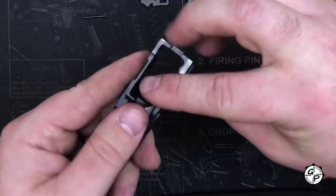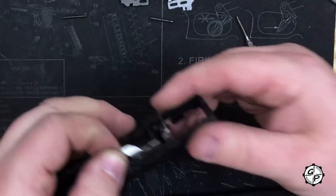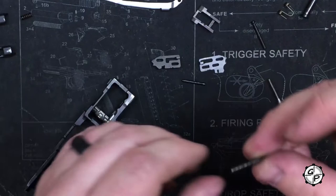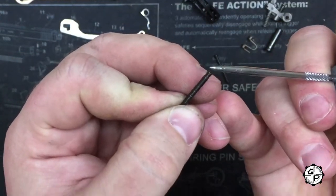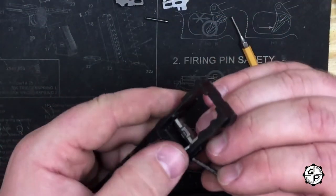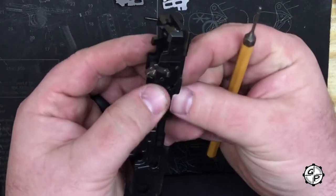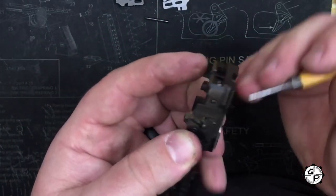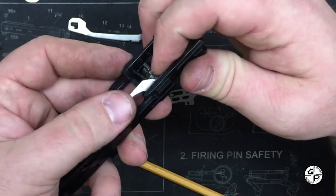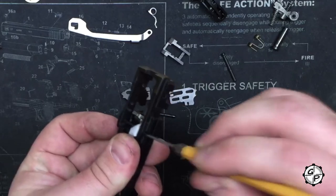Next piece we're going to put in is the ejector. This is where the bigger opening on some of these parts is going to come into play. When you go to first put this in, do not line up both holes immediately — you want to make it a little offset. The pin that goes in here has two wide turndowns on either end, then three cuts in the middle that serve no purpose other than aesthetics. Slide it in and make sure that it seats. Once you have it all the way in, be careful not to push it all the way through — push the ejector backwards, and the pin can't move. It's locked in place.